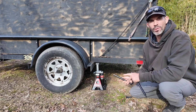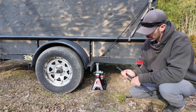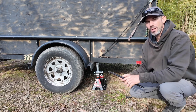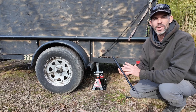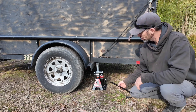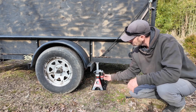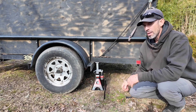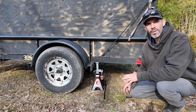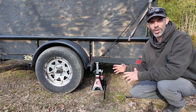Make sure the valve is shut on the bottle jack. The jack handle itself, just like any bottle jack, is two-piece — it has a pin and slot — and then all you have to do is jack up the trailer. As you start to jack up the jack, the locking feature will engage, preventing it from falling as you're jacking up.